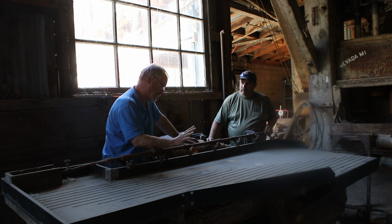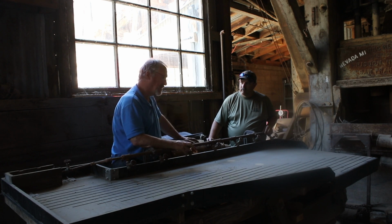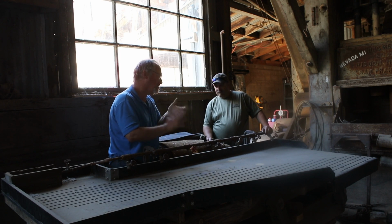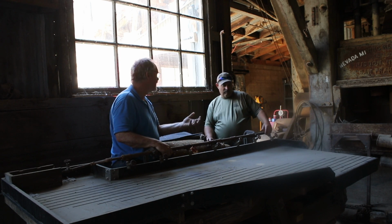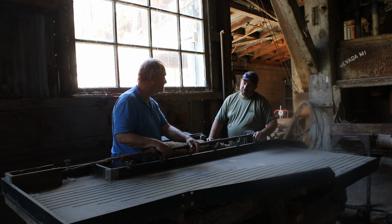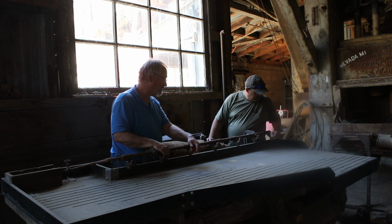you have it dialed in right, are pretty low grade, not much in there. Although, you know, if you have a cyanide system, there's usually enough gold in that it's worth cyaniding. But that's only if you're not a small operation. If you're a small operation, you're not going to have enough to make it worthwhile. But a small operation, you get the concentrate and the middlings, you do some treatment on them, and you end up with a fairly concentrated fine gold that you can actually melt and pour a bar out of. And then the bar could go to a refinery where they would pay you for the gold and/or silver values.